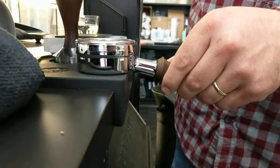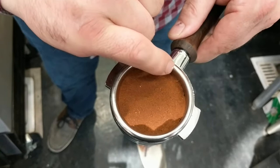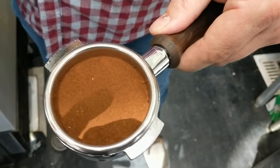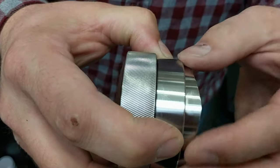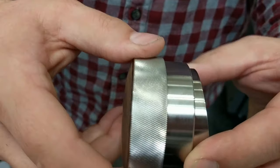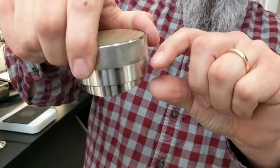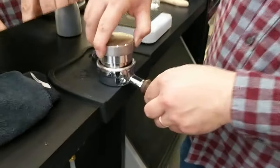We've got it preset, but there's a little bit of distribution that didn't get put over there, so I need to set the depth a little bit taller on that tool. With this tool, you unwind it — and then tighten this back down and give it a good squeeze. That increased the height of this, which will increase the depth of distribution.